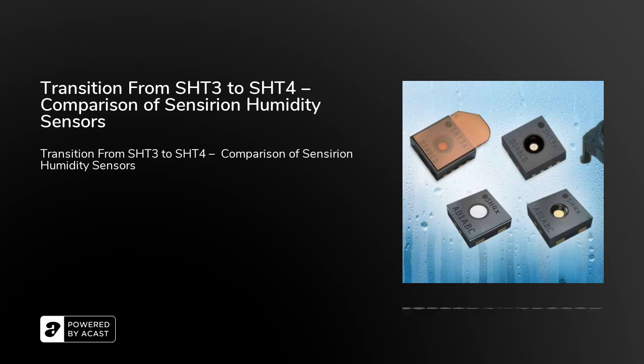Supply Voltage and Current Consumption: The SHT3X series operates in a supply voltage range from 2.15 to 5.5V, with an average current consumption of 7.7 microamperes for one RH plus temperature measurement per second in one-time measurement mode at best accuracy. The SHT4X sensor series is designed for 1.08 to 3.6V, with average current consumption of only 2.2 microamperes under the same conditions. For applications where current consumption is less critical, the SHT4XL series supports 2.3 to 5.5V with an average current consumption of 20.3 microamperes.